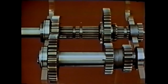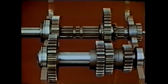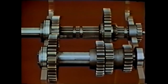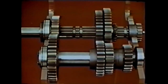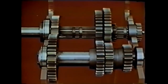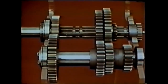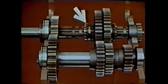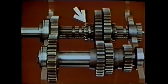For added speed we must change gear ratios. We add second gear to the counter shaft, coded blue. Like all other counter shaft gears, it is permanently locked to the counter shaft. Then the main shaft second gear, also coded blue, is added. Since this is a constant mesh transmission, main shaft second rotates with counter shaft second at all times. However, main shaft second has not yet been locked to the main shaft, so it turns about it freely — only first gear is engaged. To lock main shaft second gear to the shaft, we add a sliding clutch to the left of main shaft second. In this transmission, all sliding clutches are the same size and shape.